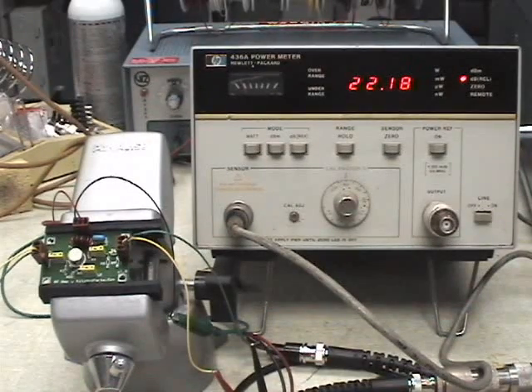So let's take a look at absolute power measurement. Absolute power is measured in dBm or dBw. dBm is power relative to 1 milliwatt into 50 ohms normally, but if it's a different resistance it'll be specified. So 1 milliwatt into 50 ohms is 0 dBm. Let's set up the output of our signal generator to 0 dBm and measure the output power of the amplifier in absolute power in dBm.